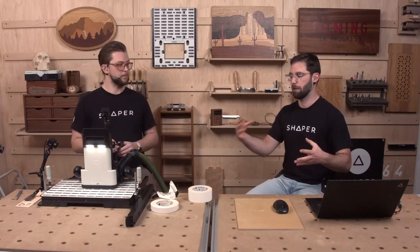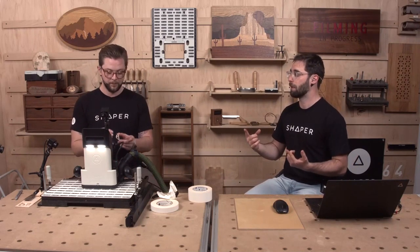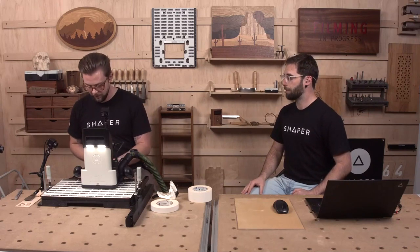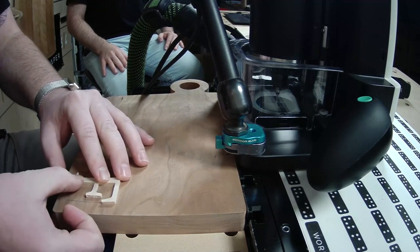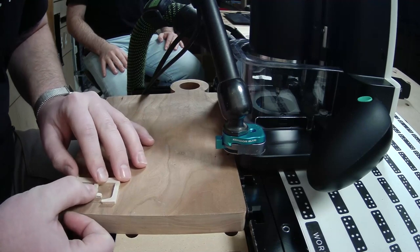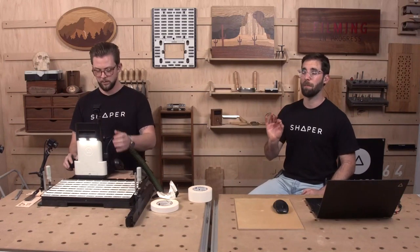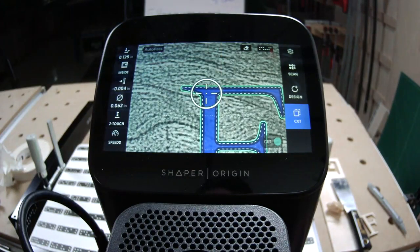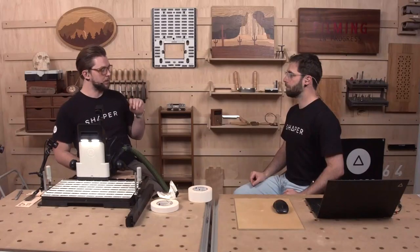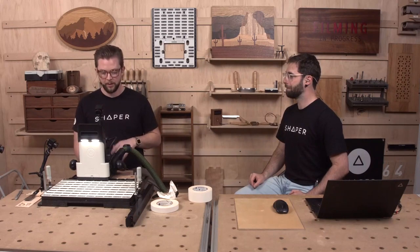If you have interference in multiple spots and try to put all four parts together, it's a lot more difficult. We're at zero offset and line-on-line — it doesn't want to go in, so four thou is going to be the sweet spot. For reference, four thou is about the thickness of a piece of paper. I also noticed my auto speed was a little high, so I bumped that down below the default of eight inches per minute to give a little more control around the corners.